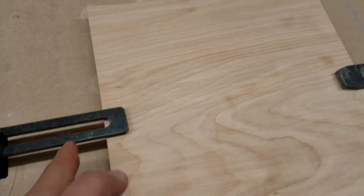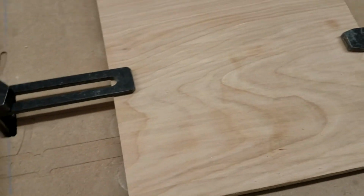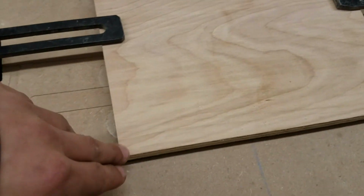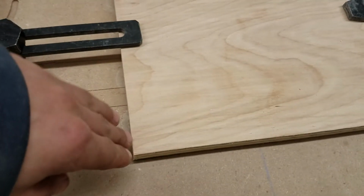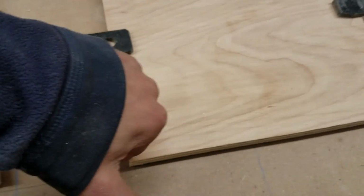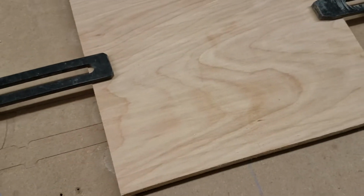but sometimes it is, sometimes it isn't. In terms of touching off the x and the y axes, I do prefer doing it on top because there's no risk of crashing. When you do it the alignment method where you're right on top, if you overshoot, it's no big deal. If you touch off on the side here, you risk going too far and then smashing your bit over, which would not be very good. Same obviously in the y-axis, but on top there's no risk of that.